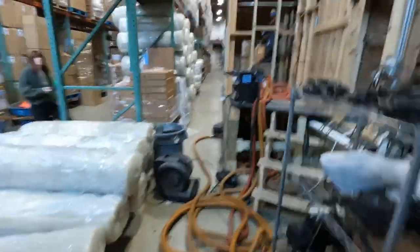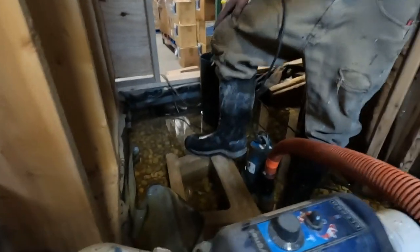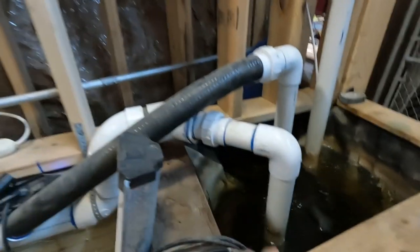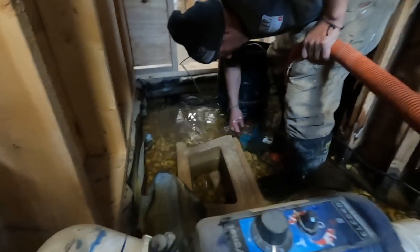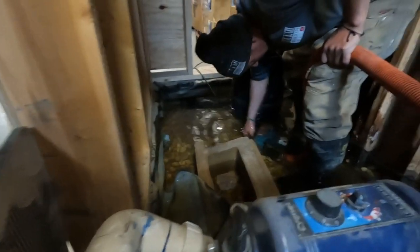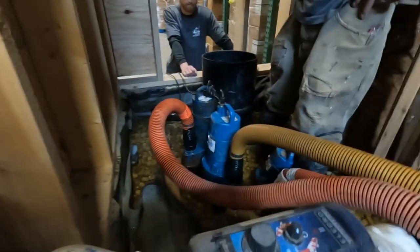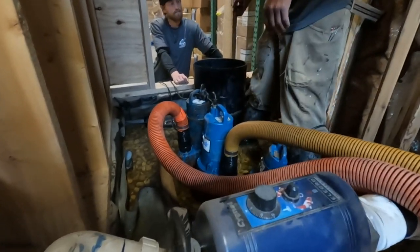Coming back here, Juan is over on our wetland filter side with the snorkels coming out there. We're dropping our pumps on top again just to get all the top debris out of the way. Coming back over here, this is our intake — or makeshift skimmer, you could call it. All the water is being drawn in to this location and we are dropping in a pump here just to rinse down this area, similar to how we did on our retail system. One of the benefits of doing the top first is so that it doesn't all get caked in the bottom and prevent the filter from fully functioning. Now that we got a lot of the top layer cleaned up, we're about to drop down our pumps. I would assume this one is a lot dirtier than the other one, so let me run outside real quick to see what we're pumping out.